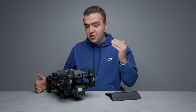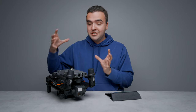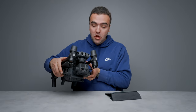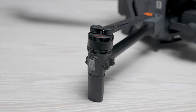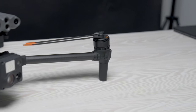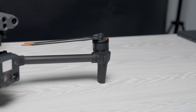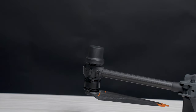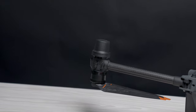Now I want to go in depth and take a walk-around of this entire drone to help you familiarize yourself with the M30 inside and out. Starting at the end of each arm, the M30 has four total antennas. On the front arms are the traditional directional antennas hidden inside of the landing feet. On the back are the two DRTK antennas — the cylindrical-looking pieces that sit on top of the arms.